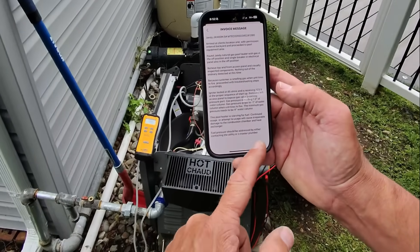The fuel pressure issue should be addressed by either contacting the utility or a master plumber. Making sure the gas is off and the system is back in the state I found it — test port secured, access covers replaced, gas valve shield on, rubber grommet around the three-quarter inch gas piping reinstalled. The display shows the check ignition steps fault, water is 71 degrees set for 90, everything reconnected and re-secured. Power is left off, and we'll give the homeowner a call with our diagnosis.